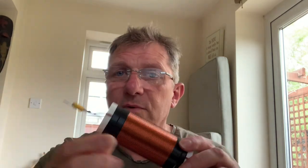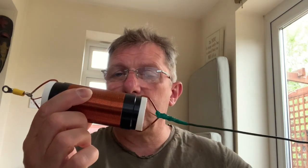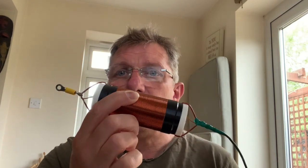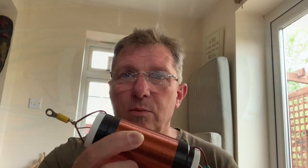So in total length it is 22 meters long rather than the 20 meters you have at the moment. If you can add an additional 2 meters to your aerial you have an 80 meter half-wave, and it works incredibly well.